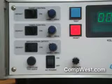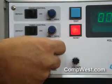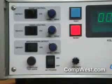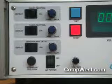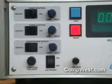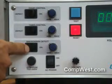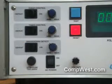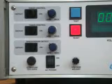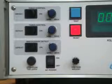To vary the leakage current limit, vary the breakdown detect control. Values can range from less than 1 milliamp to 5 milliamps for voltages up to 18 kV, and up to 2 milliamps for voltages between 18 kV and 25 kV. See the manual for proper leakage limit setup procedures. The arc breakdown circuit can be defeated by pressing this switch. In defeat mode, the arc detection circuit will not stop the test, and testing will continue as long as the leakage current output is within set parameters. This may be useful for finding an arc in the device under test.